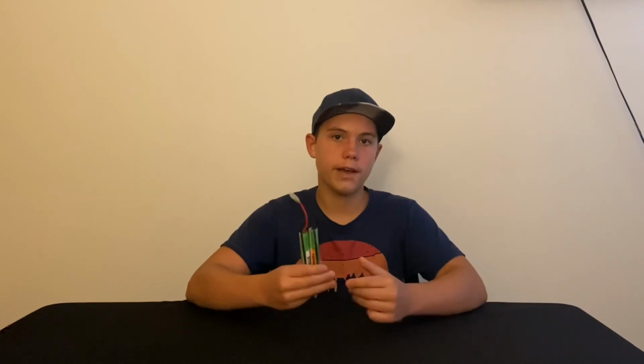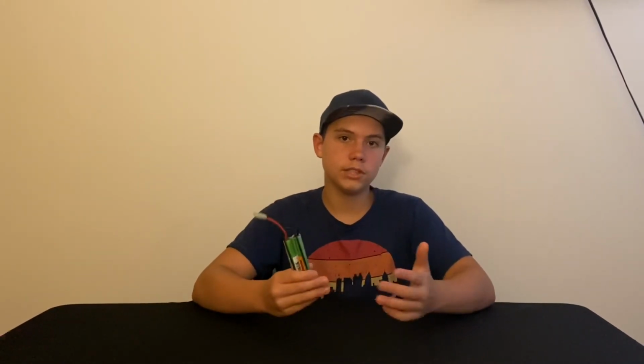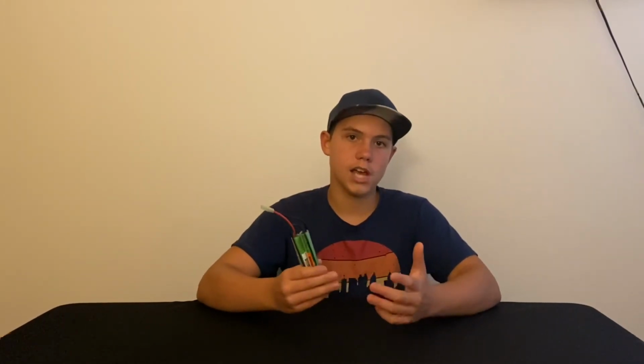Also, you want to fully drain your NiMhs. I wouldn't say every time, but maybe once a month, once every couple months, because it's just better for the battery health. And if you want it to last that full 2 or 3 years, you're going to want to be doing that. If you don't do that, it's only going to last around a year, but still, even for beginners, that's really a long time.